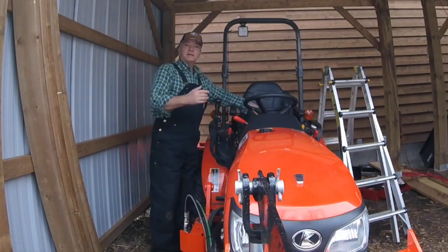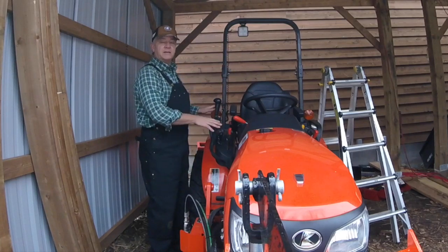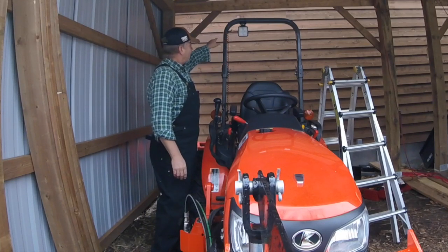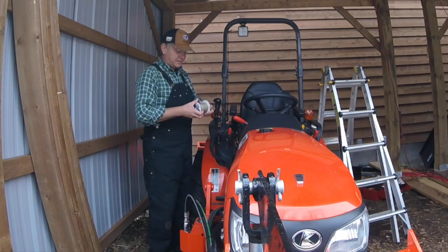Okay, so just to get you up to speed, I've got my bullet connectors, I'm ready to go. I think the first thing I want to do is just fish my raw wire out and get them in place. And as I said, I'm going to fish it through that little hole. Hopefully it'll fit. It looks like the wiring on this wire harness is about 18 gauge. I don't think it's 16. It looks a little smaller.